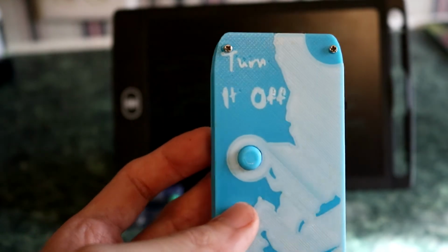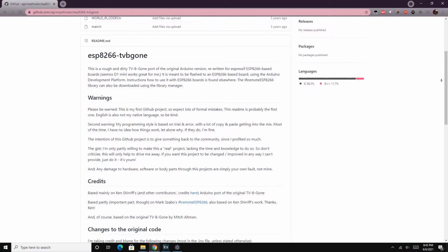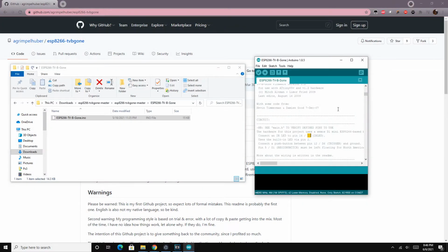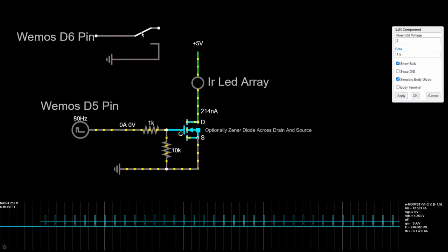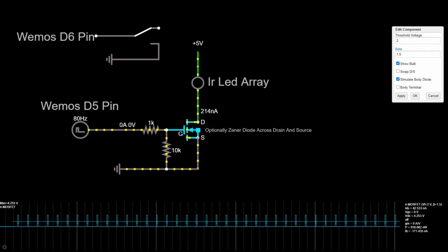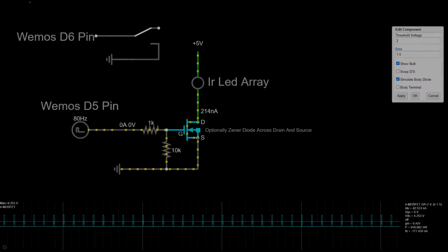So essentially you want to go over to the GitHub page, download the GitHub code, and flash that over to your Wemos D1 Mini through the Arduino IDE. Now after you've got the Wemos D1 Mini programmed, you want to wire it up as so. I'll have a diagram on screen, and in the description I'll include a better diagram. The one on screen right now is probably a bit crude, I just don't have the time to make a good diagram right away. But overall it's very easy to understand.